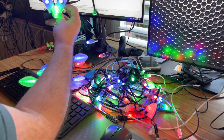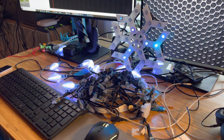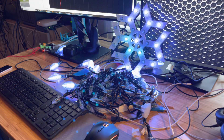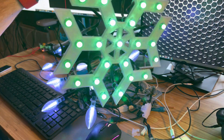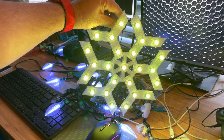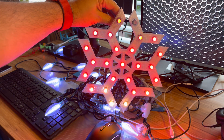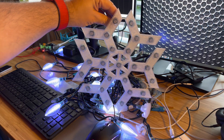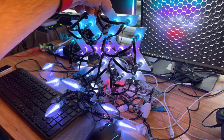Running a Falcon Pi Player with a Pi Hat in xLights bridge mode. Once you have your custom model in xLights you can start running through the regular effects - trying out radial, marquee, fade, bars, changing the color palette in a few places, using random in a few places - really just making sure my model lines up and what I see in xLights reflects on the prop. I'm running this prop at about 100% brightness, but for outdoor tests I actually brought it down to 30% because in all likelihood I'll be running my overall show at 30% brightness.